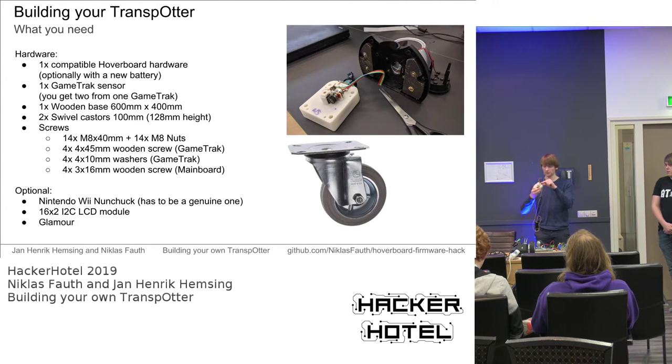It's a standard joystick you can find in nearly every cheap device you get from China with a joystick, and the joystick has a hole drilled in it where the string is fed through, so the angle of the string can be measured. All values are present on the connector as analog values, so we later need to connect these to the analog input, but we will come back to that later.